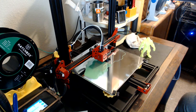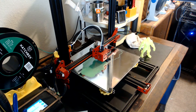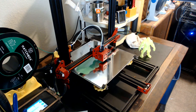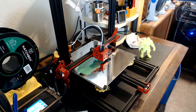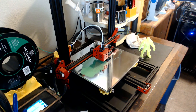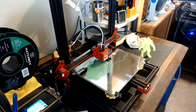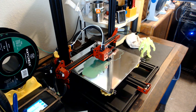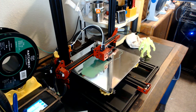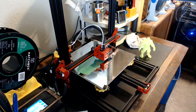We're going on this. I'm printing with my pretty much standard print settings, with the exception that I'm printing with a raft because otherwise the supports aren't strong enough to stand up on their own. I've also changed my normal setting of four top layers down to three because I'm really not sure there are any top layers on this model — I don't know how you tell what's a wall and what's a top layer on this one. I'm also printing with supports everywhere and using an overhang level of 55, which seems to work really well for me.